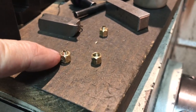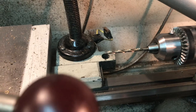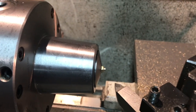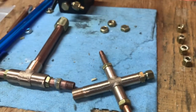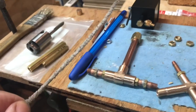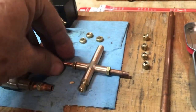Here I made a little batch of four — actually five — of the nuts for the eighth inch pipe and the 7/32nd 40 thread. I'm getting ready to just trim up the back side of it. I've got my little number 30 drill there so I can run it through just to make sure I have good clearance in the back for the eighth inch pipe. I'll repeat that for all of them and the batch will be finished. After I get done cleaning up the back and drilling out with a number 30 drill, I take the bottoming tap one more time and go through the threads and clean them out with a little pipe cleaner just to make sure they're clear of any swarf and good to go. There's one nicely fitted to the bottom. We can go ahead and make up one half of the tube for that one tomorrow.